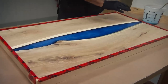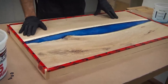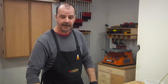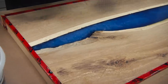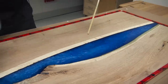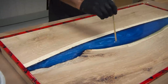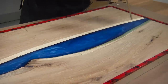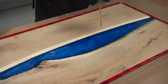Also plan for the epoxy undoubtedly creeping underneath the slabs — it will go below them, so accommodate for that in the final thickness of your top. I have no doubt I'll have to come back and take off a sixteenth or maybe an eighth of an inch to flatten this out again. I've filled it up now, and I'm using the pearl epoxy to give it a little color variation, then coming back through with a dowel to create some swirls and movement of the pearl inside the blue — just until it looks cool.